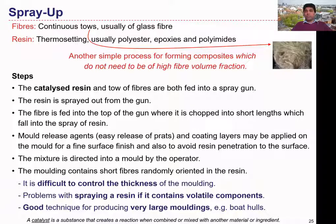One of the main issues is controlling the thickness of the component. We can keep injecting the resin together with the reinforcements, but depending on the thickness and the size of the component, we have to decide how long to spray — which depends on experience. It would be difficult to control the thickness precisely. If you want a thickness of three millimeters, it could be difficult to get an exact value; you might get some deviation, so it may be better to apply extra thickness.